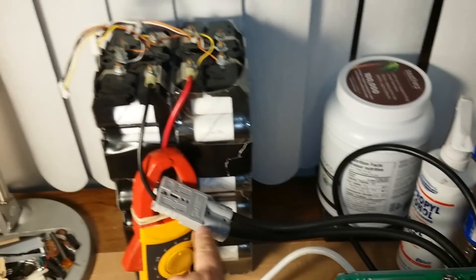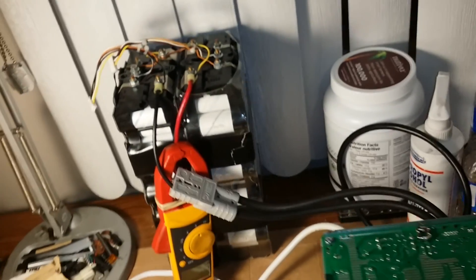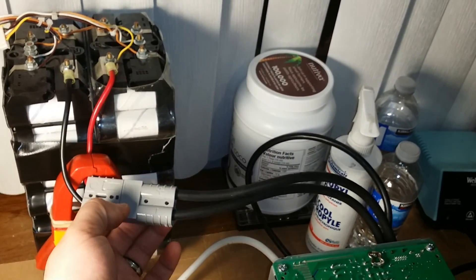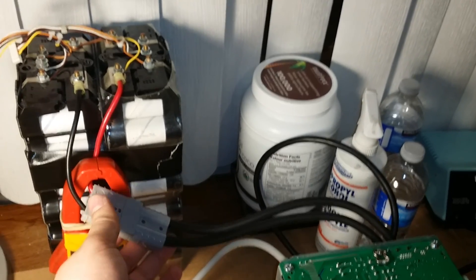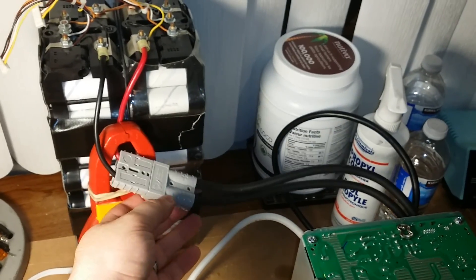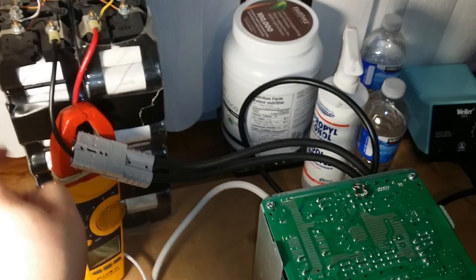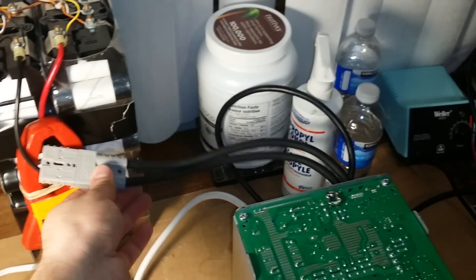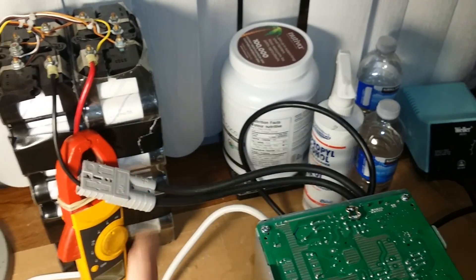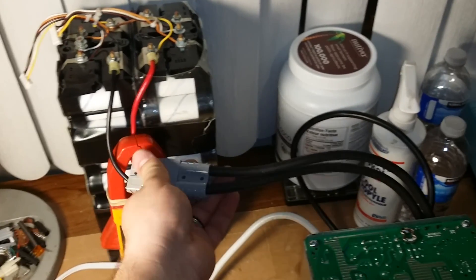What I may need to do is solder on or connect two 10-gauge wires to each of these inputs and basically run 150-amp XT connectors — RC connectors rated 150 amps each — then run a piece of 10-gauge and attach it to the 6-gauge. A lot of times it's not so much the wires, it's just the resistance in the connector. Maybe I'll try upgrading that and see if it improves.